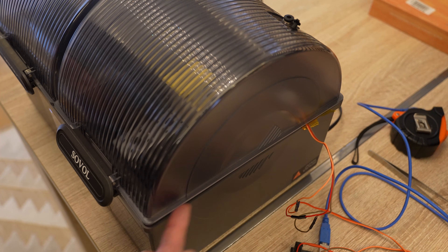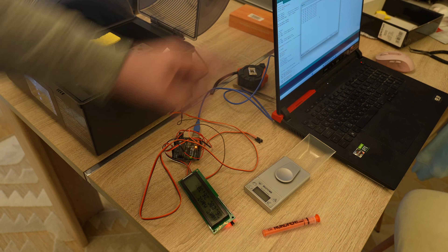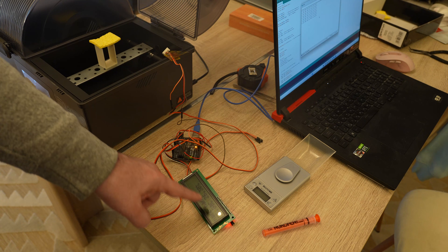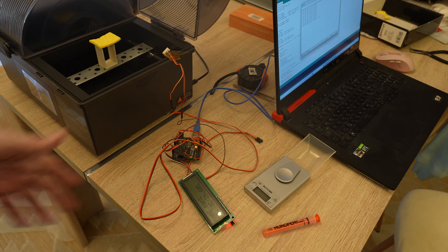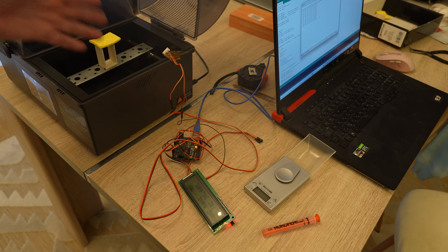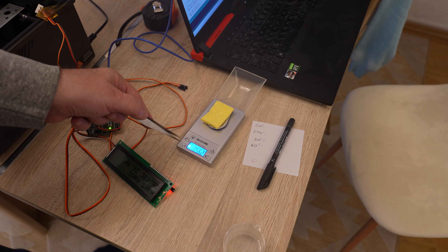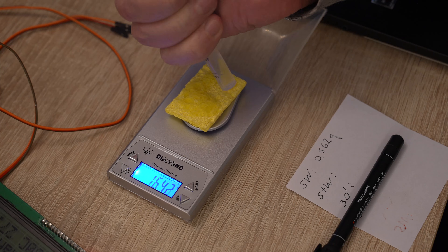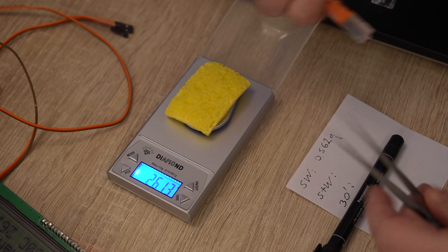There will be a small gap. Data is collected by Arduino Uno and my laptop, but the current temperature and relative humidity are also visible on screen. Currently the relative humidity is very low — only 26% in this room, typical for winter. Usually I do this test at 45%, but we will still see the temperatures. Empty sponge weight: 0.562 grams. After adding water: 2.613 grams — a little more than intended but it will be fine.